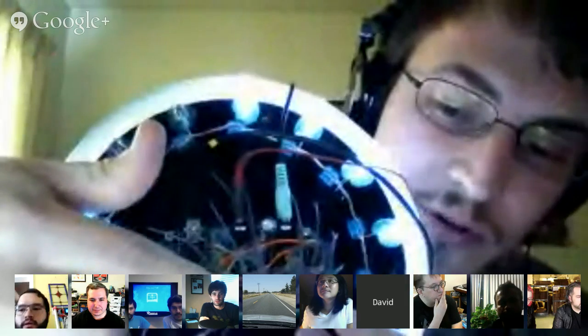And in the back you have an Arduino Nano, which is hooked up to two MSGEQ7 chips and a TLC5940 for pulse width modulation. And that's it. It's actually quite simple. Still has a few pins left for other features if I want them.